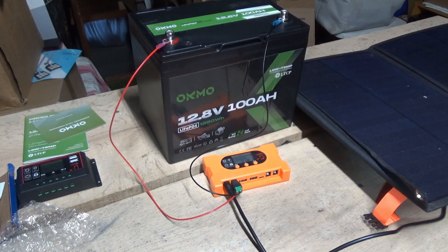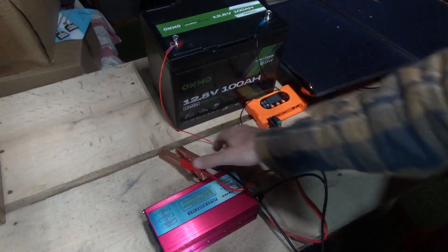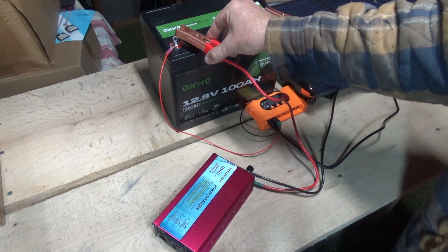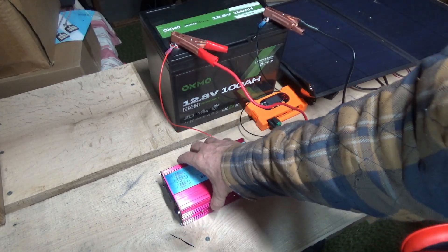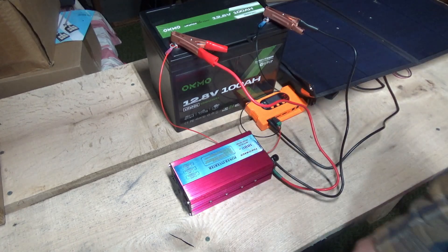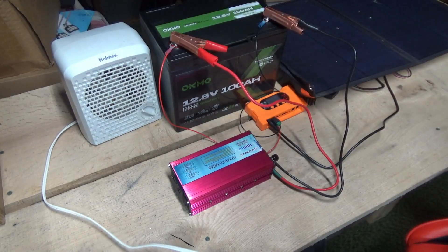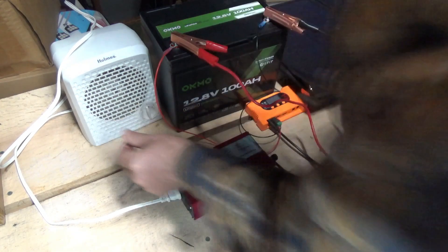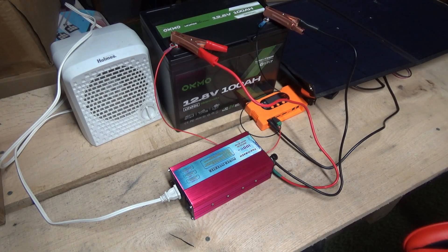I'm going to clear off the excess stuff and we'll be right back. Now this is very simple — we bring the power inverter back in play here, connect the minus to the minus and the plus to the red, and there we got that little spark again — that's totally normal. There are capacitors in here which will charge up. Then we can bring up our device that needs to be powered in an emergency situation — in this case a fan. Go ahead and plug that in, turn on the fan, and there we have a very simple field expedient portable solar power system for emergency backups.